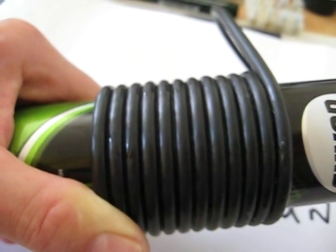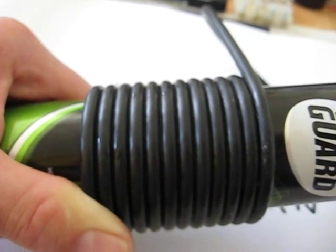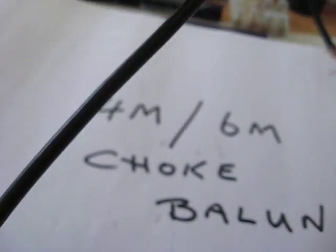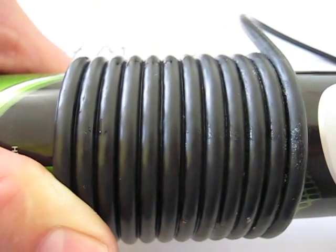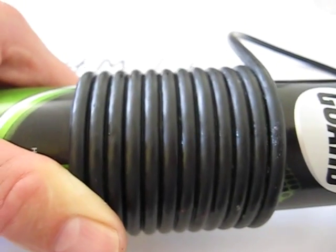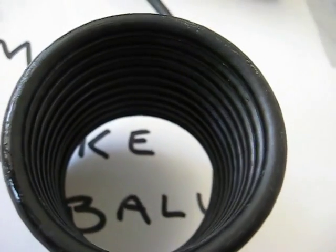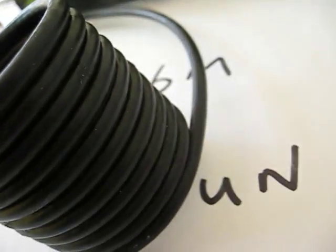You can gradually push it off the former nice and gently - you don't want to waste all that hard work. Just put yourself enough coax at the end what you need. That's all I need at the top part, or maybe even less. Use whatever connectors you want to use. Just to show you what it's like when it's off - there it is. Nice and neat.